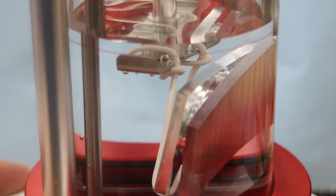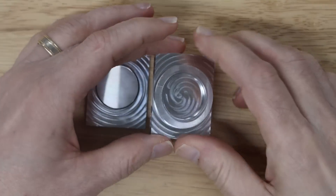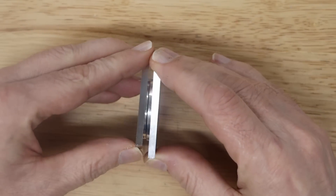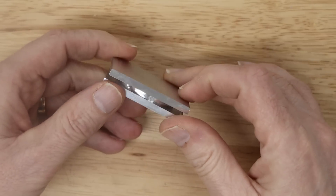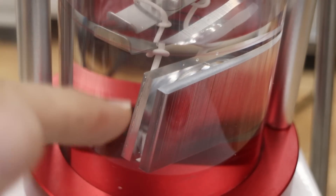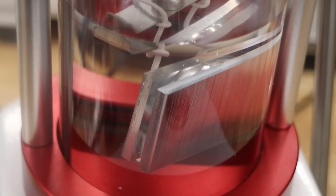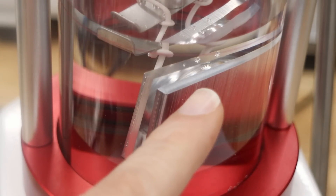When I release the pressure I am seeing a small leak — there's a bubble right there. I made a version with a slightly shallower and wider gland, using a compression ratio of 25% instead of 20%. I assembled that and gave it a good twist to test if it's waterproof. There's a little air bubble, but I think that's just air from putting it in — I can see bubbles on the aluminum away from the joint too. But when I release the pressure, I am getting a tiny air bubble at the joint.